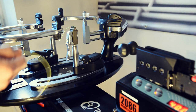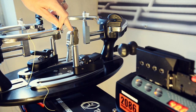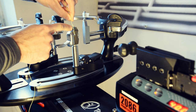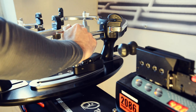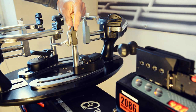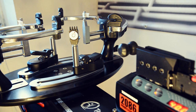And that was it — that was the effect I was expecting or hoping for at some point. It literally snapped the string through right at the entry or exit point, depending on which direction you see it. So this one was over the limit at 40 pounds. You can see how much the string got stripped and the outer layer was moving. With 35 and 37 pounds the plates were starting to move, and now you can see what happened — both plates were shifted. But still, a four-tooth clamp with such tiny teeth holding up to 37 pounds is rather impressive. Everything above 30–35 pounds is still an unrealistic test scenario.